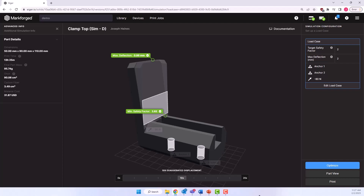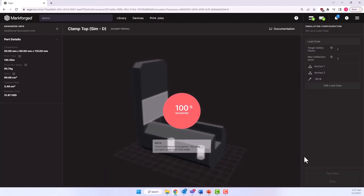What we want is for this clamped beam to deflect as little as possible, so let's use the optimization tool to help determine what it takes to reach that goal. A quick note: validation has a much quicker solve time than optimization, simply because optimization has more cases to run through. Validation takes a maximum of just a few minutes, while this optimization case took about 15 minutes.